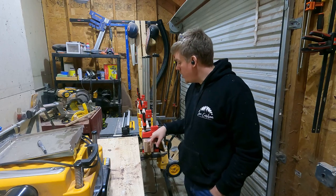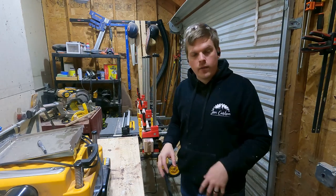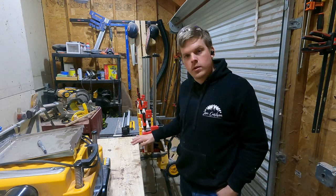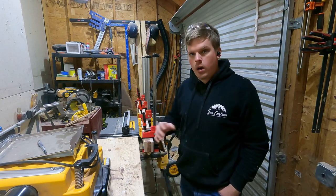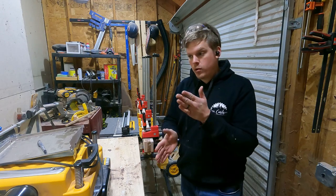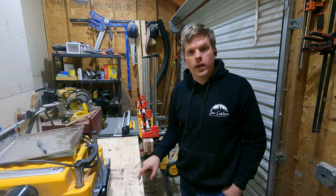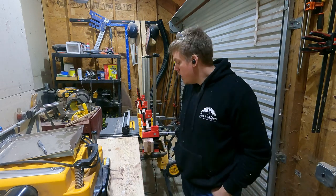And that'll be it. The miter saw will cut the individual components, and I'll inspect everything and make sure everything lines up smoothly. If this first step with the planer and table saw works out well, the miter saw is basically an afterthought, and the glue up should be really smooth. I should have really nice straight lines, which was the issue I had with the last board. I had lots of gaps in there because I was introducing angles that didn't need to be there.